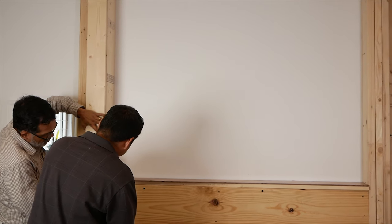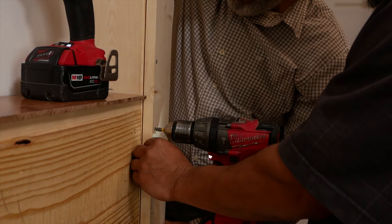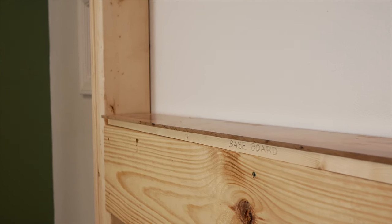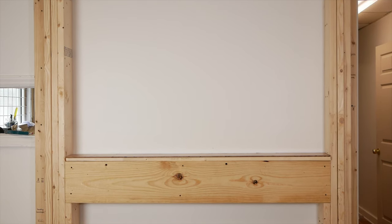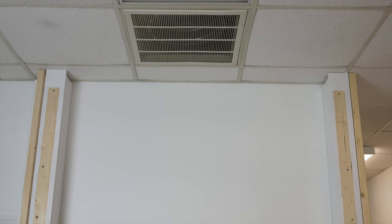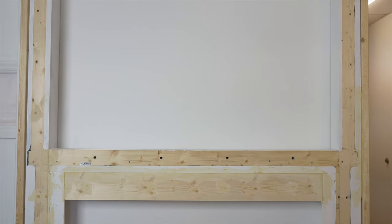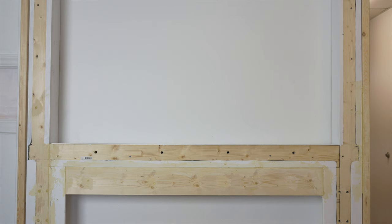First, make sure there is proper backing at each attachment point. As shown, standard wood framing calls for 2x6 lumber, therefore wood lags will be used. For special types of wall, we can provide pass-through bolts and backplates. It is the contractor's responsibility to make sure the framing is in good condition and rated for the size balcony you order. Full drawings are available for wall engineering.